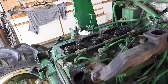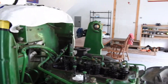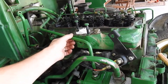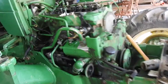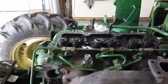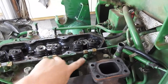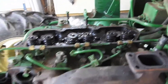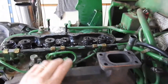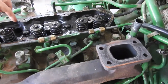I'm gonna deviate from the instructions a little bit because I really don't need to remove the starter or the oil pump — I did remove this bracket here just to get it off. The fuel injection pump doesn't need to come off, but I'm gonna take off these injectors — one, two, and three. These are the feeds for the injectors and these are the returns. I'm gonna get the returns off and then pull the injectors, then take off the exhaust manifold, and that should get me pretty close to being able to take out the cylinder head bolts.